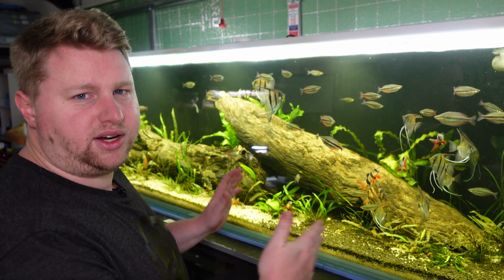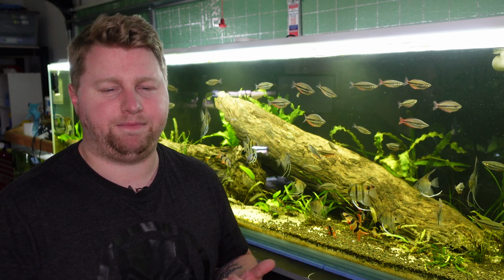For the emergency overflow, I actually used vinyl tubing on that one, and that's just because I wanted to be able to visually see if anything was going down there, because in a typical sense, when I'm standing here and the garage door's down, I actually can't really see into the overflow. So if I have vinyl tubing there and I can see water going down, I'll know then it's time to unclog a blockage or something like that. So that's why I chose to do that.